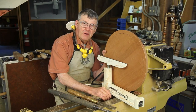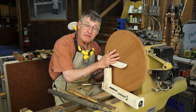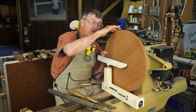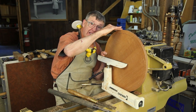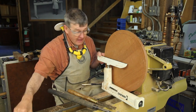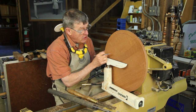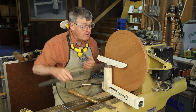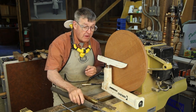I have the top chucked up and ready to go on a paper joint — I cover paper joint chucking in another video. I've just barely rounded the bottom corner and put a little bit of taper on the edge to make it look aesthetically pleasing. I've then drawn a line one inch from the edge, and we're going to recess this whole area and make it perfectly flat.